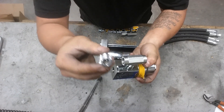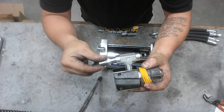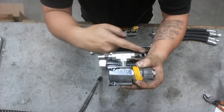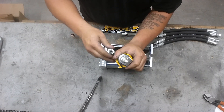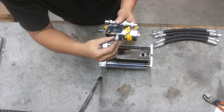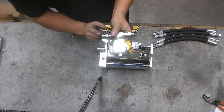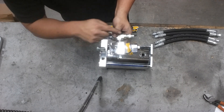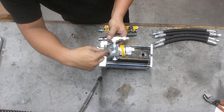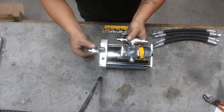I took that check valve off again. If you guys are setting it up, make sure the ball is on the swivel side of the check valve because your oil is going to come directly through here. This is going to be called a bypass dump — and the reason it's called that is you're bypassing the dump. Three-eighths plug: you're going to plug this back side. What happens when you plug it and pressurize your pump: when you hit the switch, your oil comes directly up through here, out into your cylinders. When you hit the dump, it triggers open and lets the oil come back down this way. The reason it can't come back through is because of your check valve. Make sure that check valve is right and this is plugged. And then this is going to be your return.